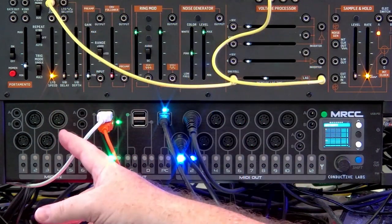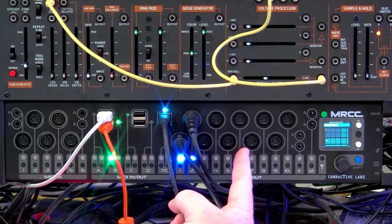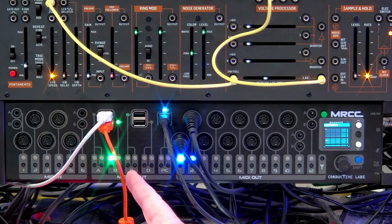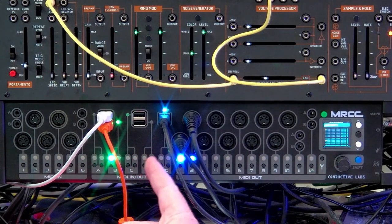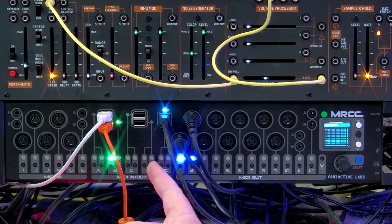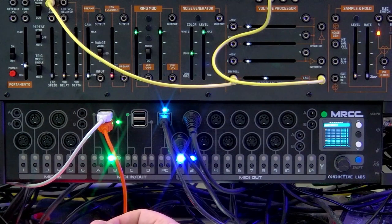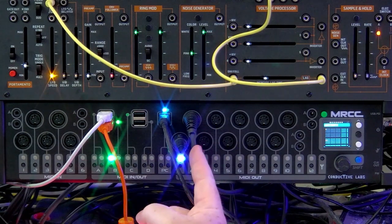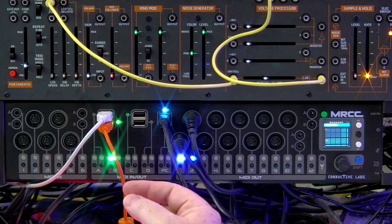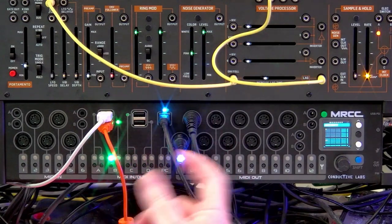It also has 11 inputs and 17 outputs, and this is based on the MIDI DIN and USB connectivity. They're physical ports, so that's 11 in and 17 out physically. And then on top of that, it has 39 in and 34 out in total. The front panel buttons have per routing, per port control. There's no need to go and access a PC or an app to do this. You can use all the buttons across the bottom to set your routes up.